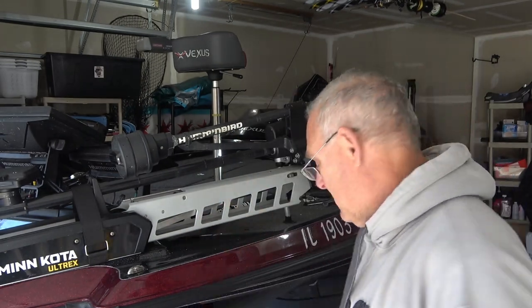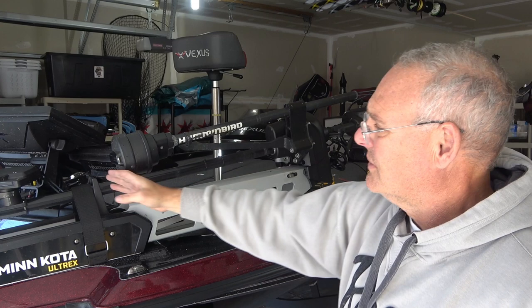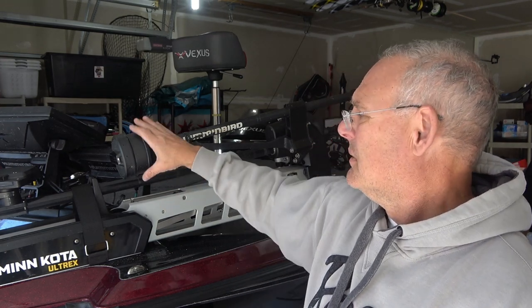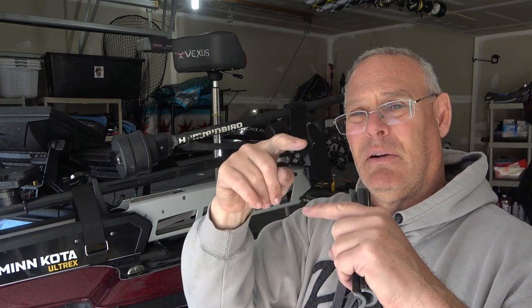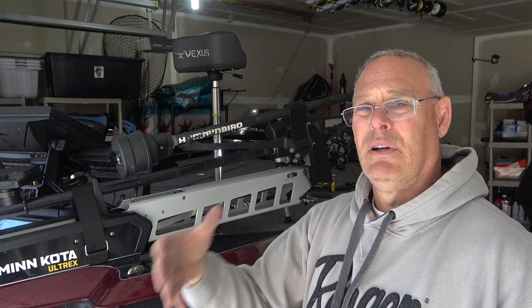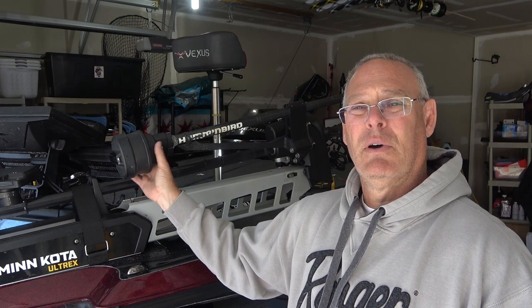There you have it — I've shortened the shaft by about seven inches. I've got two pieces that came off, those go in the garbage. I can now raise the motor another five or six inches to get it away from the LiveScope, and even on the lowest setting it won't be hitting it. It's a quick little hack, but for those having interference issues from the LiveScope, this is a good way to go. A lot of pros on tour are doing this too — if you watch Brandon Pawlonek, his LiveScope is literally barely under the water. You only need the top two metal sensors underwater for it to activate, so you don't need it plunged a foot or two deep. Get just a little bit of it underwater and you'll have a great time with this 360. I think it's the most important piece of equipment on my boat. Thanks for watching and we'll see you next time.